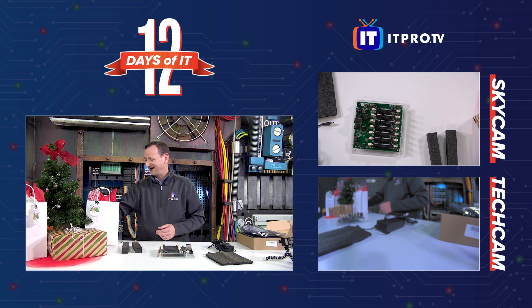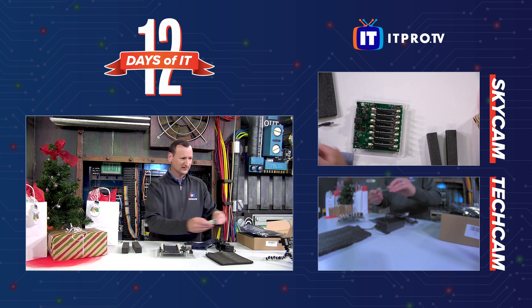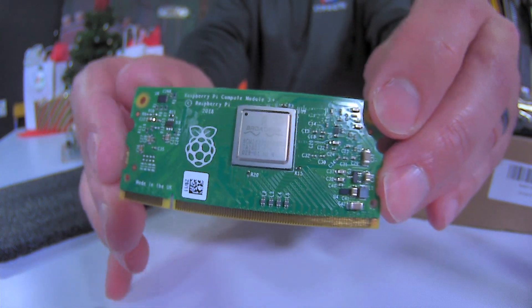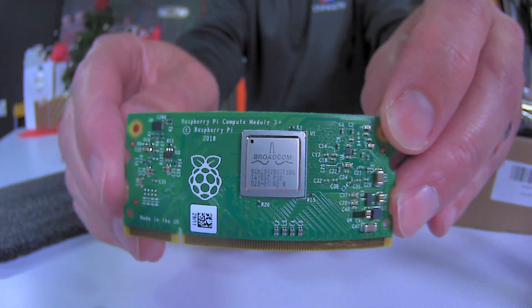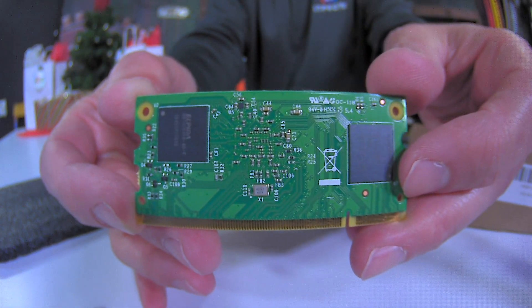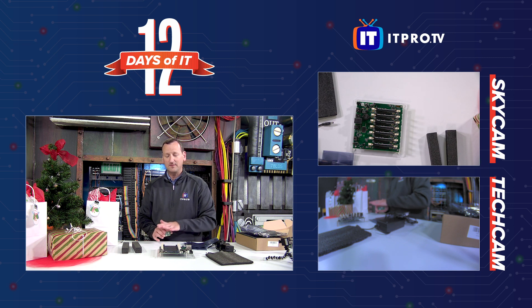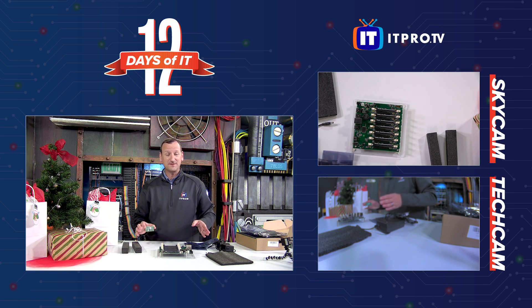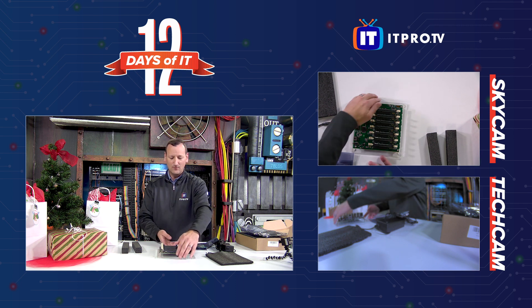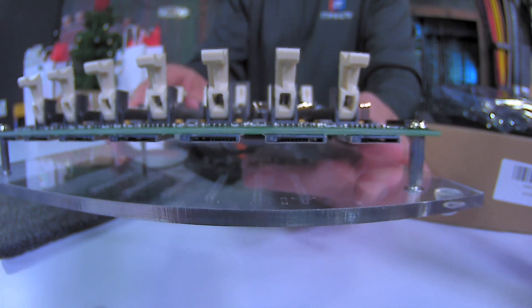Again, I just happen to have seven Raspberry Pis laying right here alongside me. As I mentioned earlier, these are in an SODIMM form factor, so they look kind of like laptop memory, but they've got that ARM processor right there. Depending on which model you order, they have one gig of RAM, and this particular model has 16 gigs of eMMC mounted on it. It's important to mention that because you can also buy a compute module without any flash memory at all — in that case you would need to use an SD card. If we look at the side of the Turing Pi, there's an SD card slot right along here, one for each of the Raspberry Pis. I'm not going to need that because my compute modules already have it.